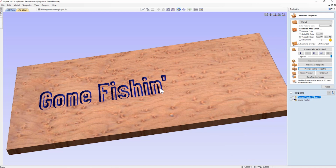The only thing I used to color code on the toolpath was the actual V-bit, so you can see what it is. It went along the outside, so that's a V texture. A lot of people like that versus a straight down texture, and that works out really well for giving you a nice sign that you can then paint this letter.